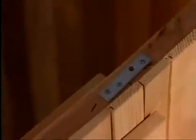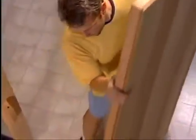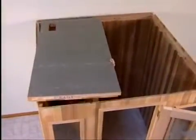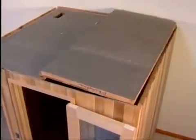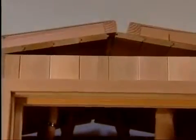Now you are ready to install the ceiling panels. Like the wall panels, the ceiling panels are marked for positioning. The side marked back faces the wall. Carefully lift the panel over the sauna and drop it down into position — it will rest securely on the top wall edge. Then lift the panel marked number 2 into position. To interlock the panels, push both panels up at the center from the inside and let them back down into their final position. Line up the grooves for the ceiling panels with the wall panels.